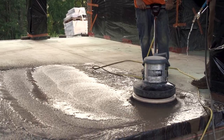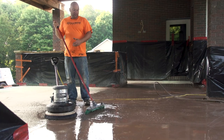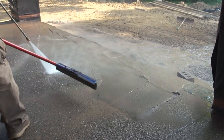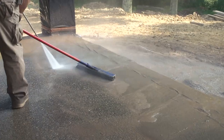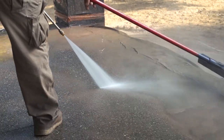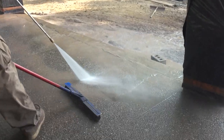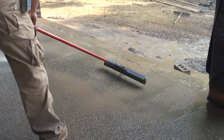When you're working around finished product — brick or whatever, or even on a driveway — another good thing to get into practice is after you scrub brush this, you have a lot of slurry. So it helps to have a guy pushing it off with a broom or a squeegee. That way, if you just take this and pressure wash it right now, this stuff would be up the wall five or ten feet. We have plastic over everything here, but this stuff's going to go everywhere. So if you just push it off first, you're going to create way less of a mess.